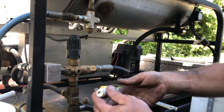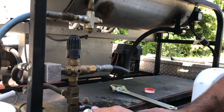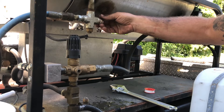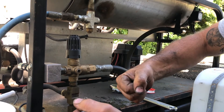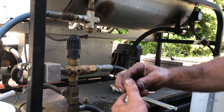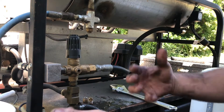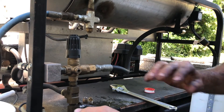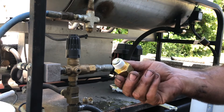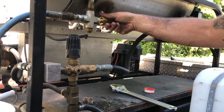Super easy to fix — it's a half-inch fitting. Take the old one out, Teflon tape, put the new one in. I had actually put a cap in here that I had in the toolbox. I don't recommend doing that at all — I did it just to get by to finish up a job on Friday. I was constantly on the trigger so I never released the wand, because I didn't want to destroy the pump. I put that plug in just to finish the job, then had one of the guys turn the machine off while I was still squeezing the trigger to get it shut down. I ordered these yesterday and they're here already, so thanks Bob from Pressure Tech.